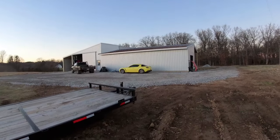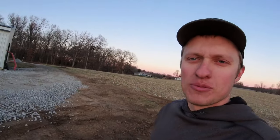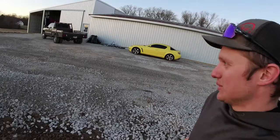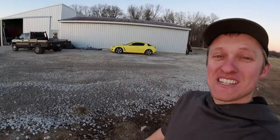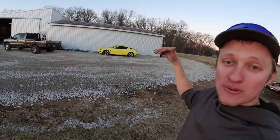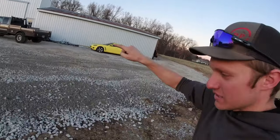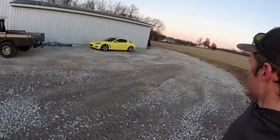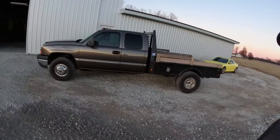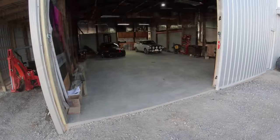Take care of your drainage. In addition to the huge investment into re-skinning the building, if you're going to build something be prepared to dump some money on the ground in rock. This is probably six tri-axle truckloads of rock in order to get this building from a dirt floor to where it is now. Moving to the inside — you might not think it looks like that much rock out here, but trust me, it's built up to provide a good foundation for a concrete floor.